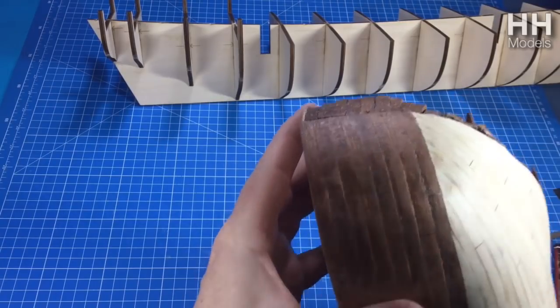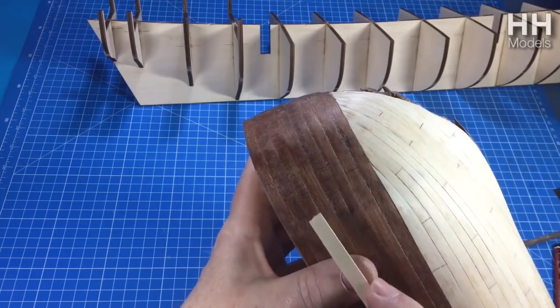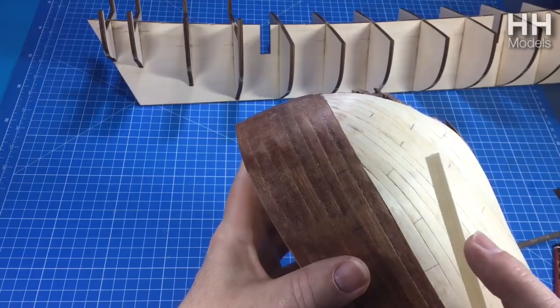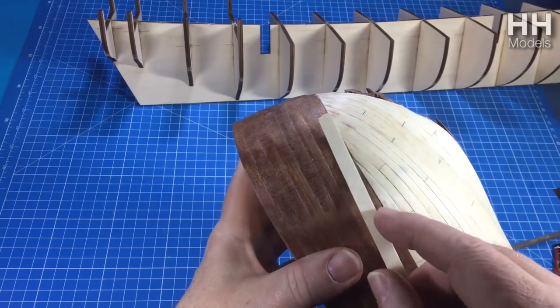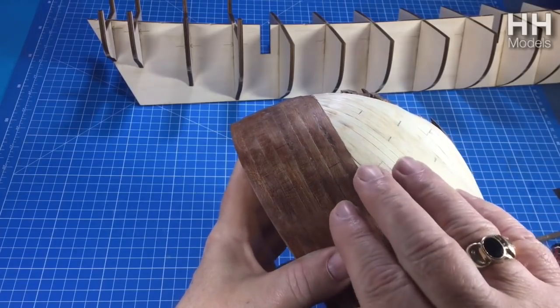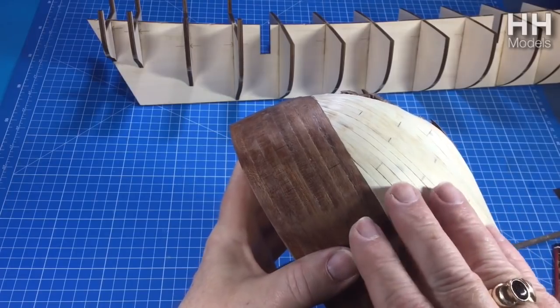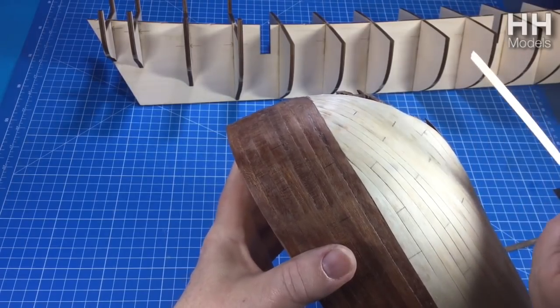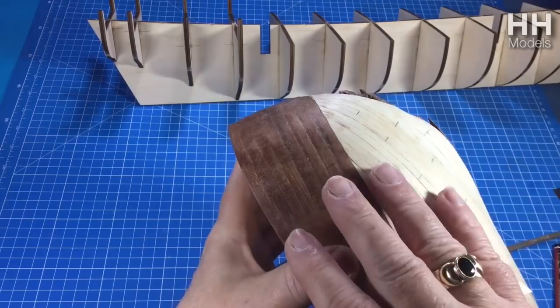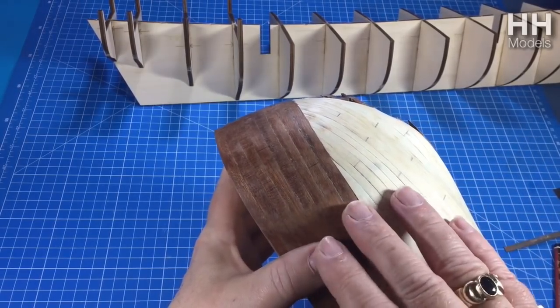If you are fighting your planking — fighting the hull shape — you'll have a nightmare of a job. No amount of bending, cursing, and hammering will solve your problem; it will just keep pushing out. You don't want your hull to be so sprung because you've got planks bent so far that as they dry, they try and rip the whole thing apart like shock absorbers. That's how people warp their frames.